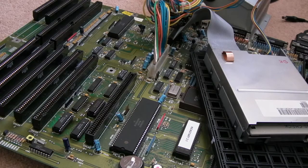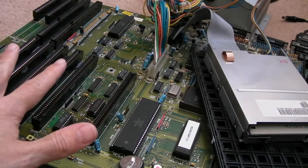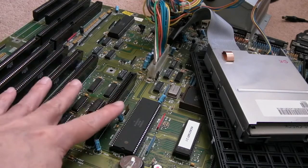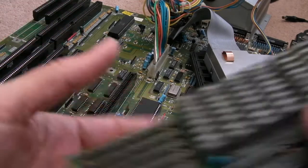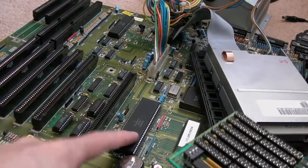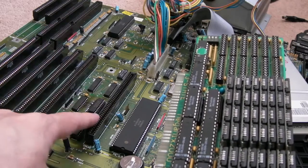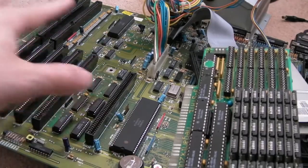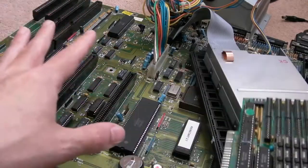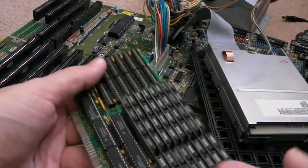And you might think this is a pointless exercise, but actually there is mileage in this, because one of the things I've found is these A2000 boards, due to the different versions of them, the differences between them, and the modifications, some of which I've done to my other 6.2, this is a 6.2, makes boards like this compatible or incompatible with other boards. So I'm going to try a number of things. We'll try it with a stock CPU, see whether it works or not. We'll try it with the A2630. We'll try it with the Terrible Fire TF534. And I'll try it on my modded 6.2 board, which has got some modifications compared to this one. And again, try those combinations of things, and try it in a Rev4 board as well, because you may find, for example, this works perfectly in a Rev4 board, it struggles in a 6.2. I found that with some of the older boards.